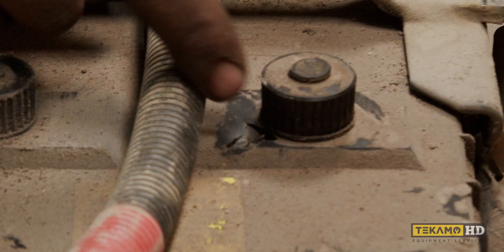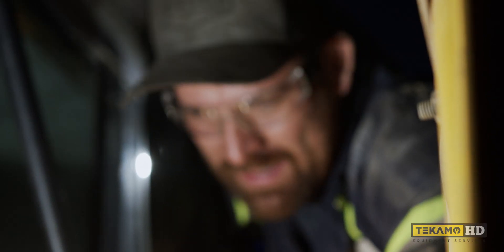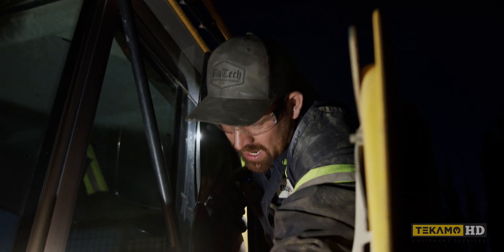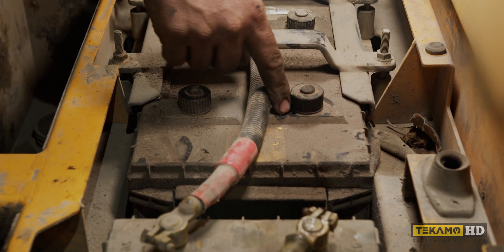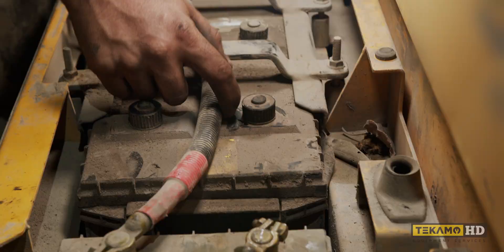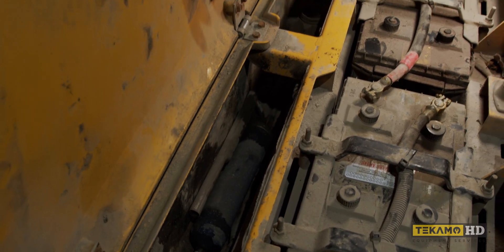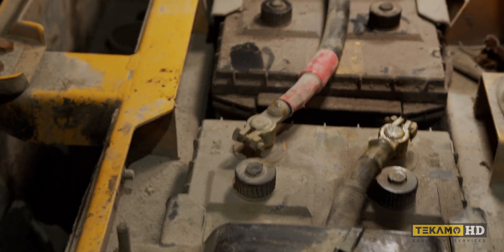A little hole actually — I can barely fit my finger in there. It looks like somebody dropped something on it. I pulled the cap off and looked inside, and the water level is very low. The reason I think it's a hole punched in it, as opposed to the battery having popped or exploded, is that it's very small damage. Another reason it's probably punctured is that this is where the toolbox is — right beside me here. A guy putting his grease gun back at the end of the day drops it and hits the battery — who knows.